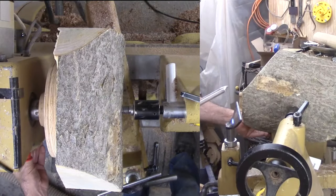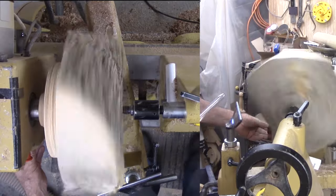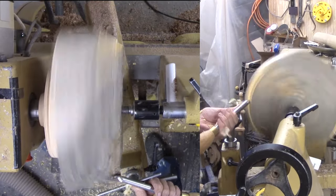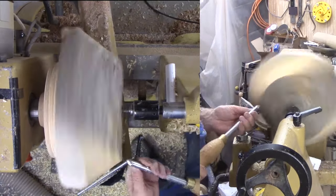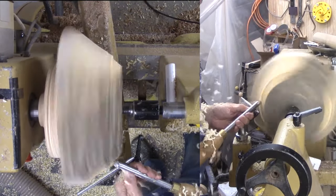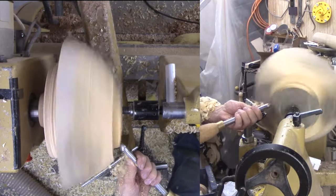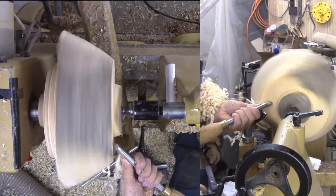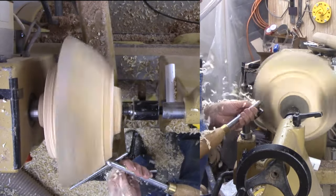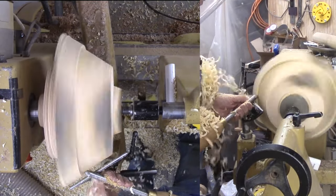This wood has a flat side where the log was ripped in half. This allows me to use my pin faceplate on the spindle. The pin faceplate is simple — a bunch of screws driven through the faceplate with the points protruding about an eighth of an inch. This, with live center pressure, is more than enough to keep this heavy, wet wood secure. The bark is thin and solid, so I do not need to drill a starting spot for the live center. This setup is ideal since I can adjust the plank to optimize how it will turn. I rarely try to round off a big blank like this one on the band saw — besides the wood being very heavy and therefore dangerous to cut a circle at the saw, I do have room to adjust the mount. I have clipped the corners with the chainsaw but nowhere close to the final circle.